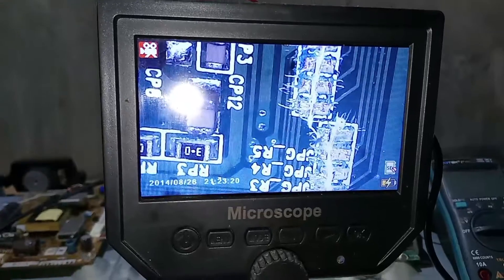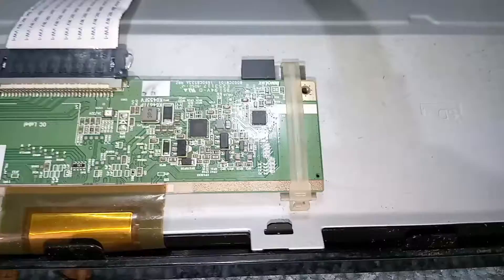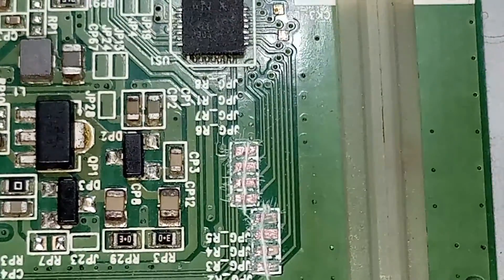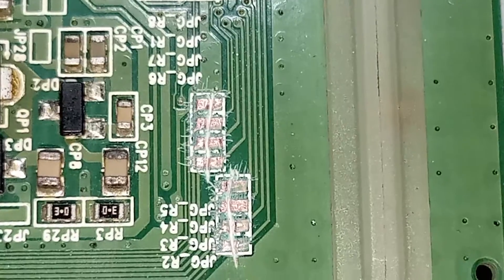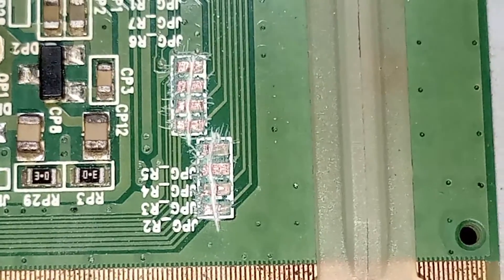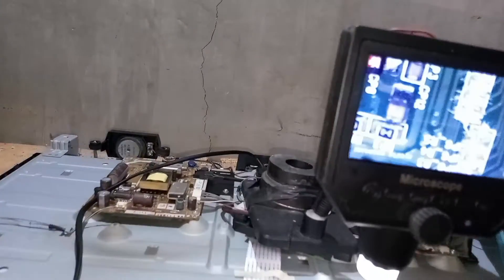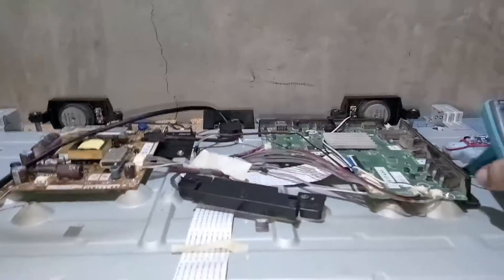We scratched it to make it easier to cut, and we can quickly resolder the line back in case I cut the wrong side. If I'm not mistaken, I cut the six clocking voltages from CKV-1 to CKV-6, including the two negative supplies. Correct me if I'm wrong. I'll remove everything on top of this TV and plug it in to see if there is any change.